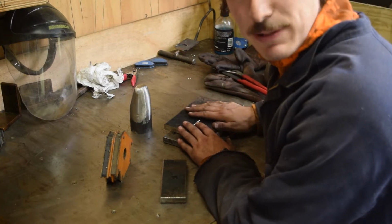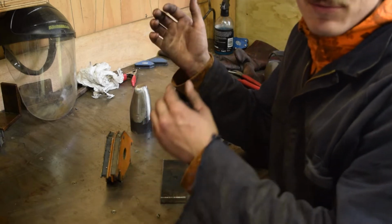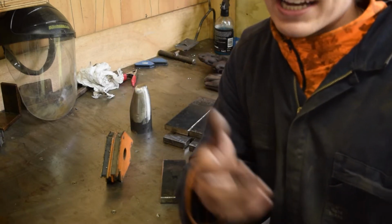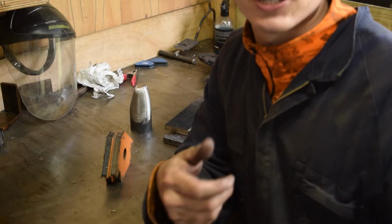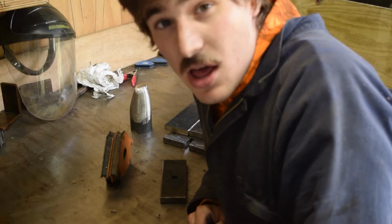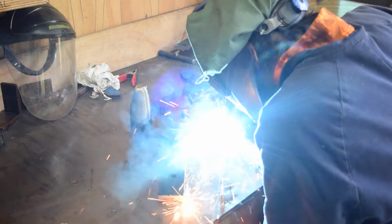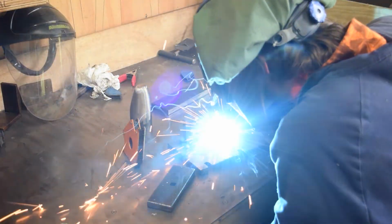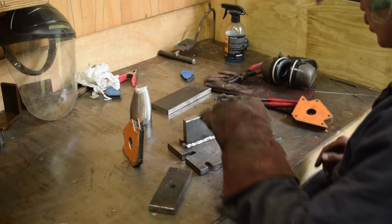Weld this whole base plate together, so we're only welding the Hardox last, and then we'll drop it straight back on the forge. It doesn't actually fit inside the forge, but just sitting on top, hopefully there's enough thermal mass there so it does cool off over the next few hours. Anyway, let's crack on. One bloody hot weld there.